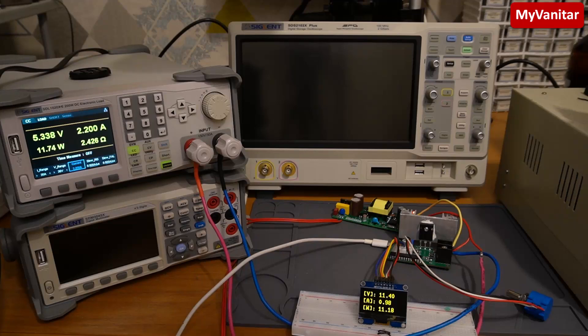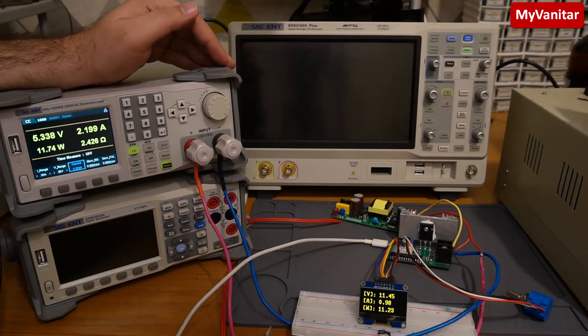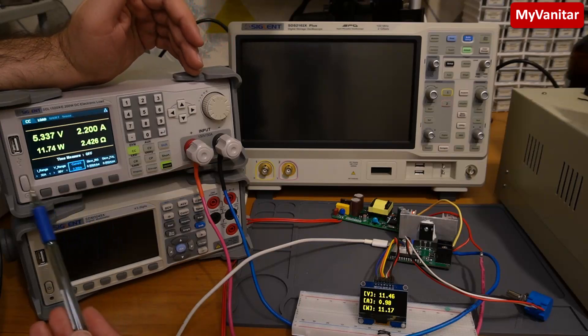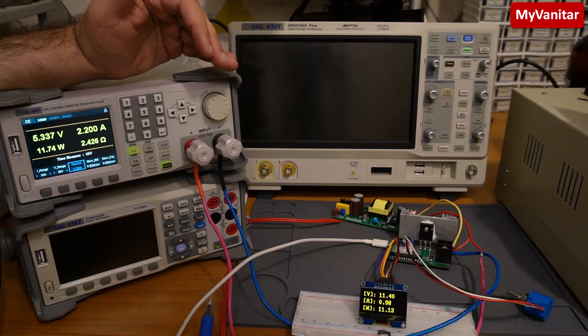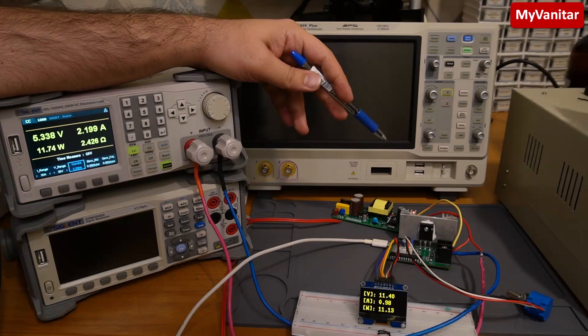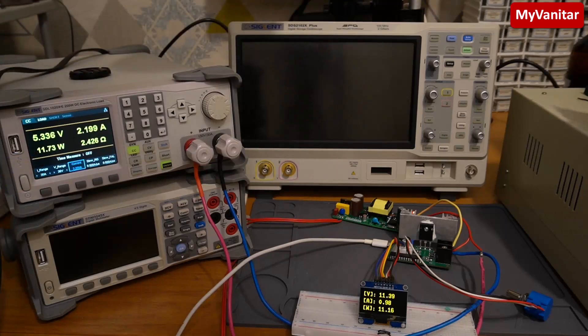As mentioned, I use the weighting regulation method because we have one feedback line and two outputs. I put more weighting on the 5-volt output because more current is drawn there and it's more important. We'll have semi-regulation for both outputs, not as tight as a single feedback for one output. If you don't like semi-regulation, remove that resistor and modify the other value — you'll get tight regulation on 5 volts, and for 12 volts you can use a linear regulator or a buck converter.